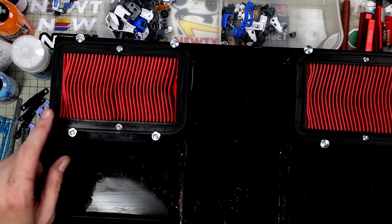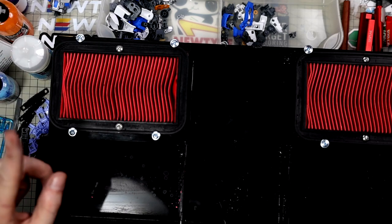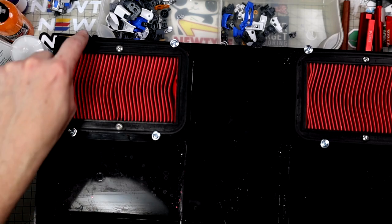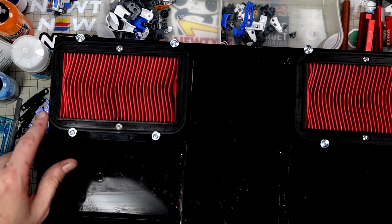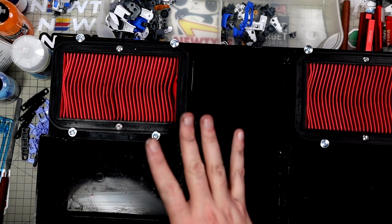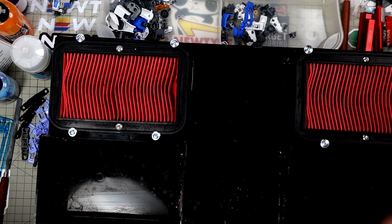So what I did was I took some machine screws and I ended up drilling holes. Drill holes. Don't just try and put the screws in right next to these. And then I slightly snugged them down because there is a foam underbacking underneath this edge. And now it's nice and secure, and there's no daylight, there's no anything around these. So that should prevent that problem.